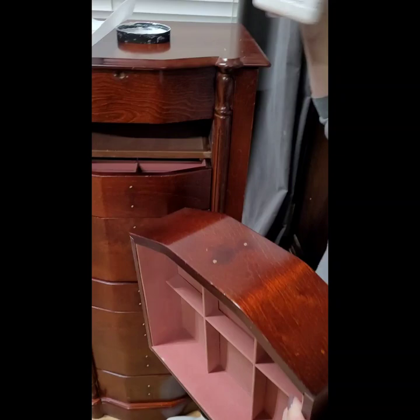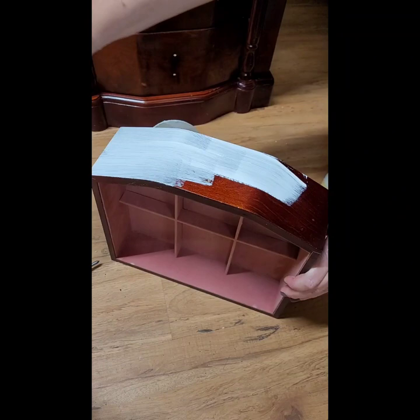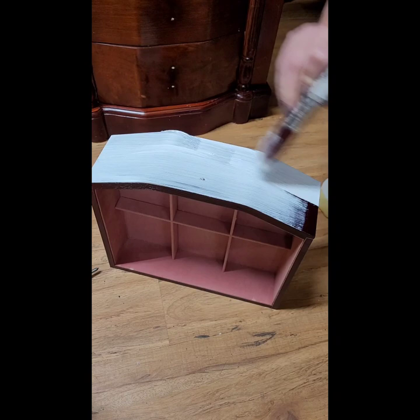The Slick Stick also served to camouflage the dark wood. Because my finish is in lighter colors, I'm going to go ahead and use this white base to my advantage. Slick Stick is a water-based primer, and so I can brush it on using my good Dixie Belle brushes, knowing that I can rinse them out easily with soap and water cleanup.